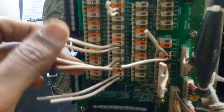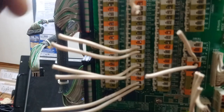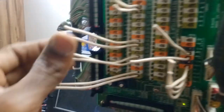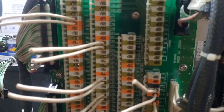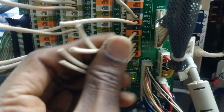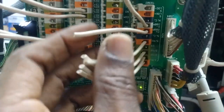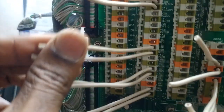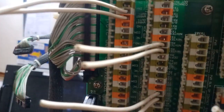Meanwhile, for the interface connections like gyro, GPS and the radar input for the TT, as well as the radar overlay: here we don't have a radar overlay, however you can connect the external input for the target data from here. For the gyro, we have step input and log pulse, the GPS and GPS2, the AIS and the depth. So we have these inputs available here.